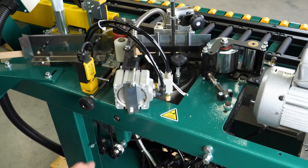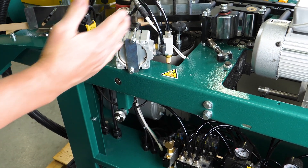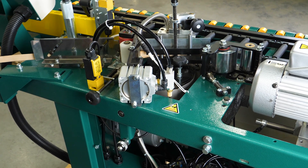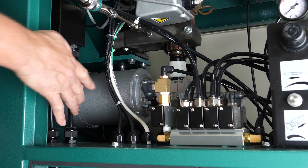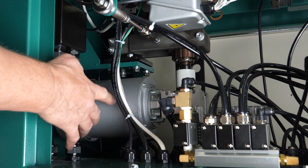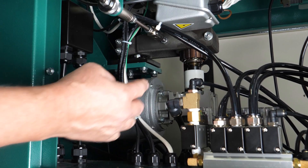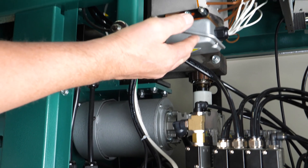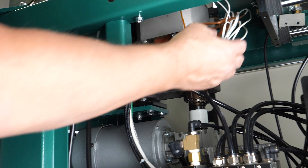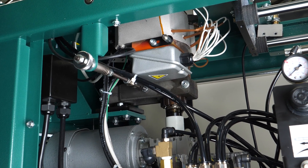I'd like to reiterate this knob here, which adjusts the whole glue pot assembly to move forward and aft in relationship to the edge of the board. Next, the motor assembly here runs your spindle for your glue pot — it is located right here — and you have your coupling drive assembly running up above. Above that is a junction box which houses all the wiring for your heater assembly.